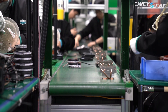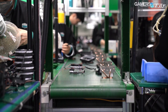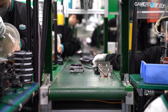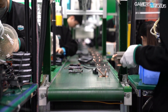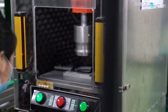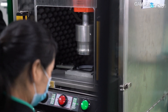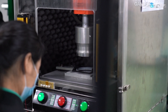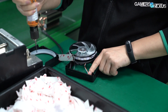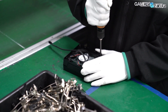We've finally made it to the actual AMD cooler assembly line. The assembly line is just under 80 feet long and is fairly straightforward. Workers on opposite sides load the heat sink while others load the fan, the fan's plastic housing, the PCBs, and so forth. Next, the LED diffuser and the fan housing are loaded into a small press that briefly vibrates and generates heat to bond the housing to the LED ring more firmly. The next worker grabs the fan and housing and secures the fan cable with an electric screwdriver, after which another worker screws the four corners of the fan into the housing and applies the metal retention kit.